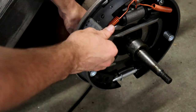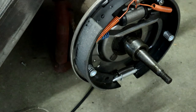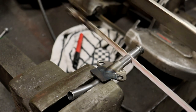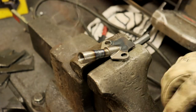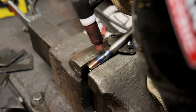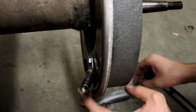Here I'm removing the piece where the brake cable is designed to insert into, which kind of guides it into the inside of the brake. I'm going to cut off the top of that, which will allow me to then weld on the piece I just made. You can see it just kind of fits right on there. For this weld, I'm not really using any filler wire — just doing a fusion weld around there. That seemed to work just fine; there was enough material for it to fuse itself together and it won't experience a whole lot of stress. So I can insert it back in and thread the cable right into place.